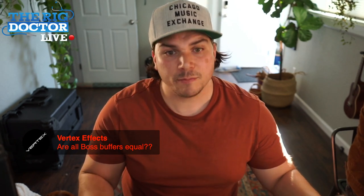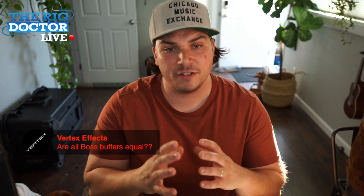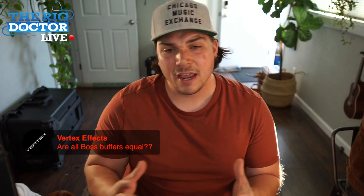So there are some differences buffer to buffer on Boss, but they all are based on the same kind of FET style buffer. It's not an efficient way to do it, but I think they're very tied to that style because it's just the way they've done things, and it's a signature part of their sound. They're certainly not neutral sounding. I don't find them to be a great sound. They can be okay if you've got one or two here or there, but it's not something I would rely on and say, well, I got a Boss pedal in the front, a Boss pedal at the end, and my buffer problems are solved. It's definitely not that sort of situation. So that's what I have to say about that.